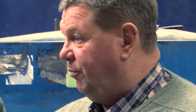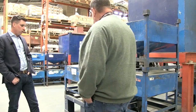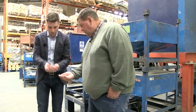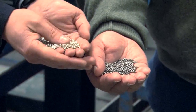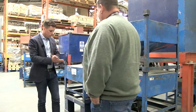So we've gone from the top — we've seen how the shot comes from ingot form, gets smelted, comes straight down, and is produced through the grading machine. It comes into here, into these vats, and then it's gravity-fed from these vats down into the loading machine. I can see we've got two types of shot here: standard shot and diamond shot. If I put my hand in the standard shot and then look at the diamond shot, you can see the colour difference. So anybody looking at standard lead or diamond shot can now see — there's no comparison. And this is all gravity-fed straight down into the machines.